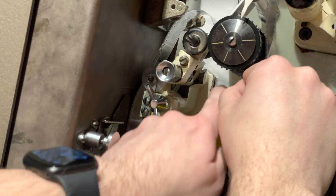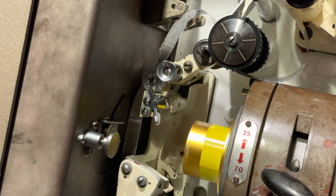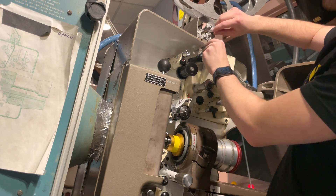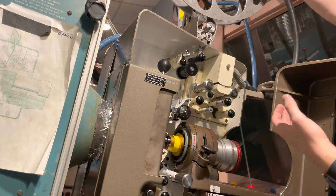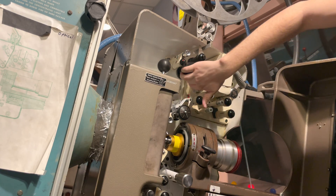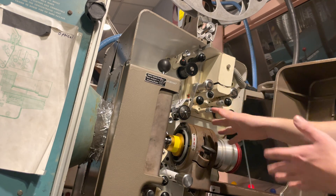We make sure the film is underneath these sprockets, and then we close it and double check it again. It seems okay — see that beautiful loop right there. Now that we've dealt with the main portion over here, we want to thread it through these fire rollers right here and make sure there's a clean path. We tighten it a little bit and it runs through here — these are all just passive, so we just pull against it. We don't care about this assembly — this is for 70 millimeter. We run through here, and we've completed the top half. Now we've got to go down towards where our sound is.